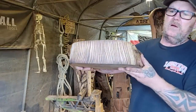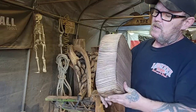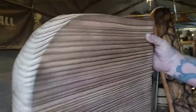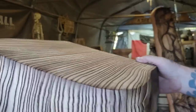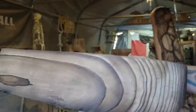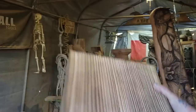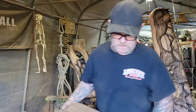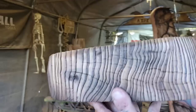So here you go. Here's me showing you. It's kind of hard to see the front there, how it's kind of bumpy. That's what the shosugi ban does. So that would be face grain. That would be edge grain. This would be end grain looking at the butt. That would be end grain. And then this would be face grain right here. I normally do the shosugi ban with face grain, not the edge grain, because the edge grain is just lines, right? Okay, so there's the face grain.